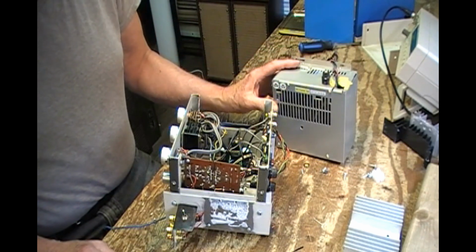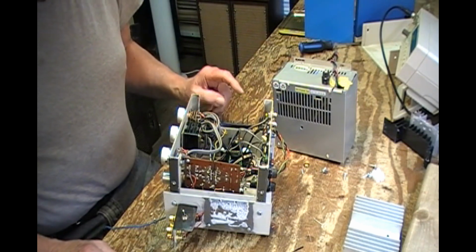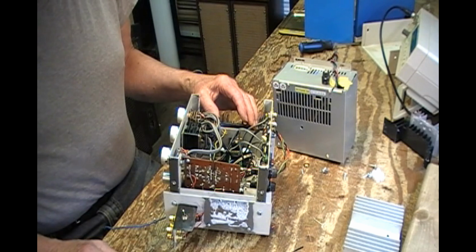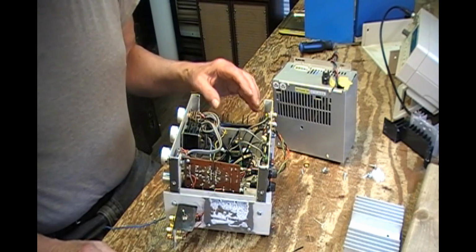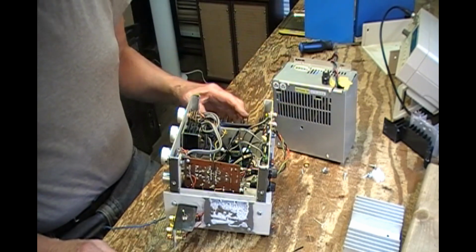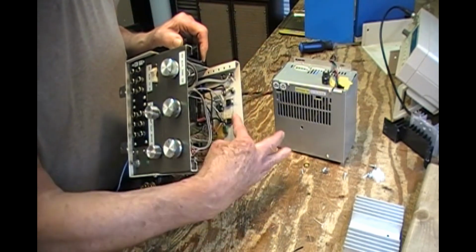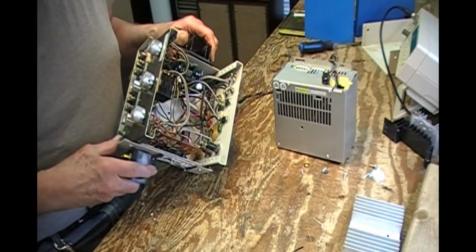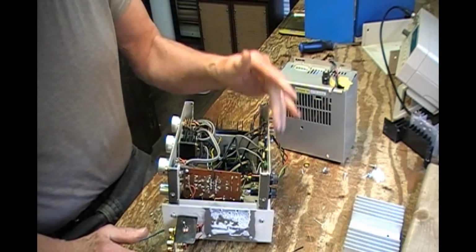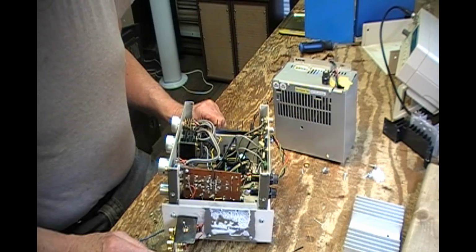Okay, the problem I've had when using this with these power amps is that the input ground is somewhat isolated. There's a 10 ohm resistor in there, and because of that, when I use the same power supply and then these regulators in here, if I can show them, plus and minus 15 volt regulators, just 7815 and 7915, when I use them as well, it creates a hum, and it's noticeable.